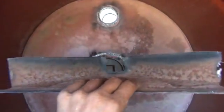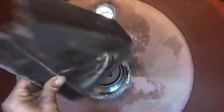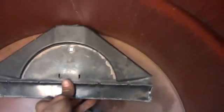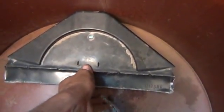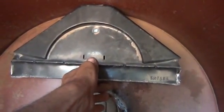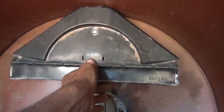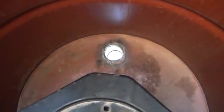We're also going to install a pressure relief valve into this that I'll show you how to make. You can see we've got about a two-and-a-half inch depth of walls coming up there, and it's going to sit just like that — right to the back, creating a nice draw where the angle this thing sits at when we have it open. We'll also make sure that's at the perfect angle so material's not flying up inside of there. This is a safety measure so that our gas pipe output doesn't get blocked up. So let me weld that into place and I'll show you that from there.